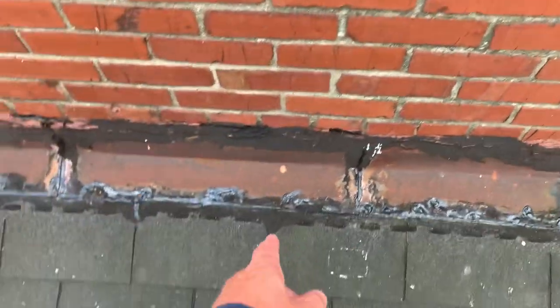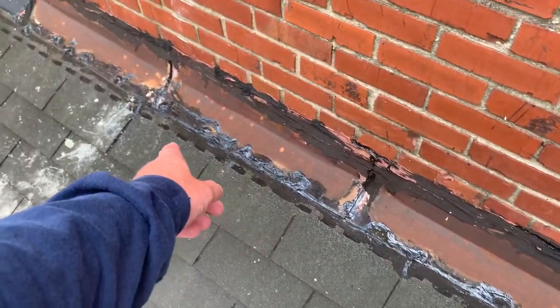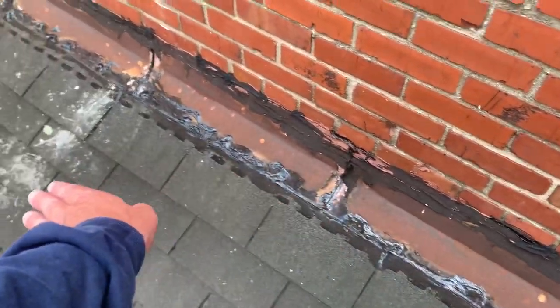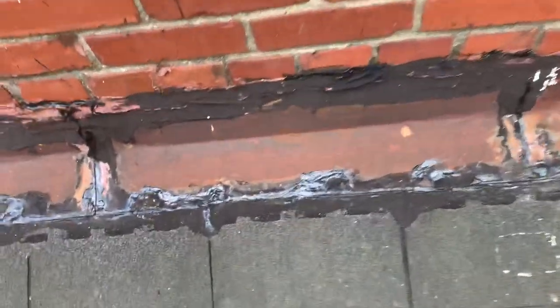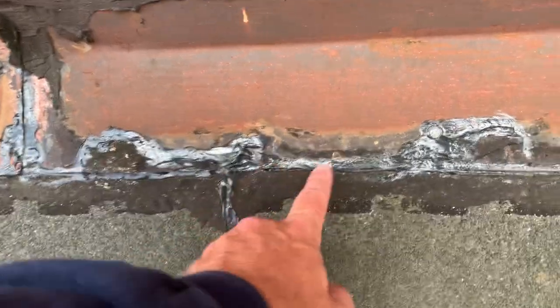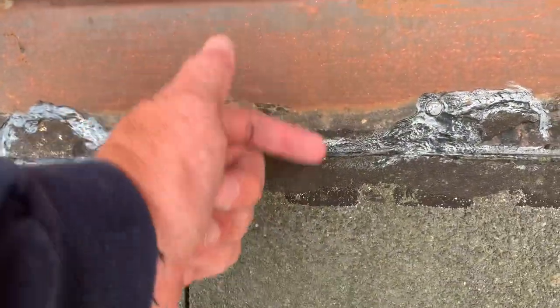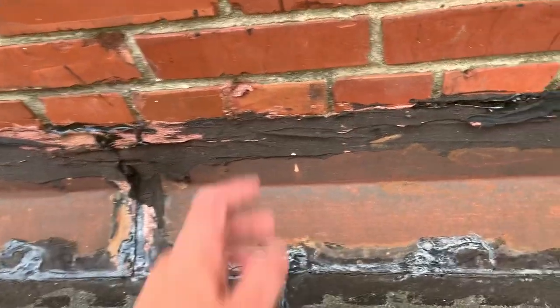This course of shingles — see those little black dots? They've fallen out of position, you can see them drifting down that way. When you look at it, all these keyways will leak. There's a backwater lap, so the flashing is lower than the shingles, meaning anything that rolls across it will get in. This tin looks like it's from the 1940s.